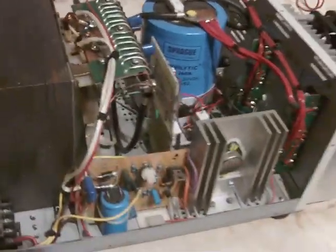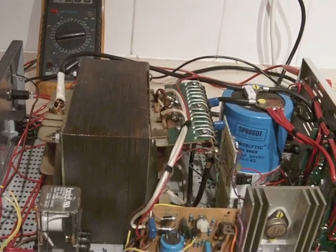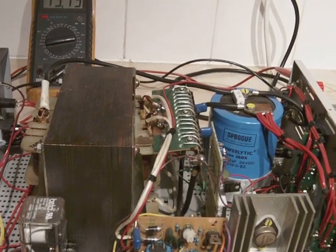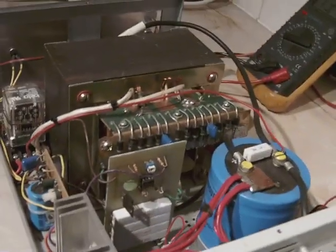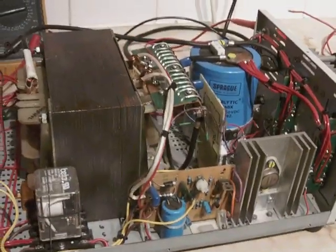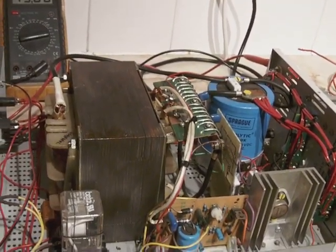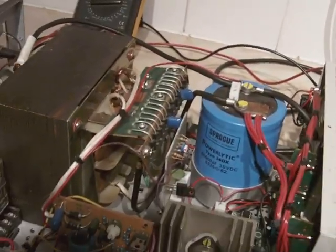More than good enough for most things. I think the most important thing with a high current power supply — or any PSU you're going to run a radio from — is definitely over voltage protection. I don't see the point in spending, say, a hundred quid on a PSU, one of the cheaper types which don't have over voltage built in, and then putting a thousand pound radio on the end.